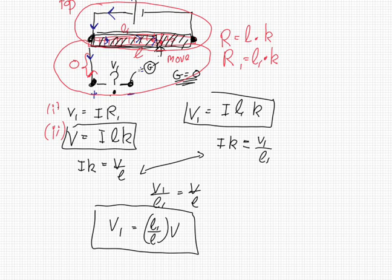No, I've tried to draw it in red and blue on purpose. The blue one is the current coming out of the top battery. The red one is the current coming out of the bottom battery. If you have two batteries together, all that happens is the current cancels, but you can still have a current flowing if one of the batteries is bigger than the other. So for example, if this is 1 volt battery and this is 9 volt battery, I put them together, I make 10. But if I turn this one around, it's like I make an 8-volt battery. Oh. Yeah. Okay. So you can still have a current going when the batteries are opposite if one is bigger than the other. Okay? Which actually comes up a lot in the Kirchhoff problems, circuit diagrams. Yeah? No?